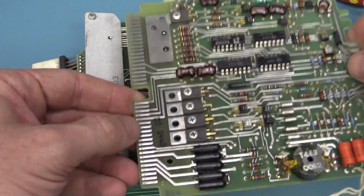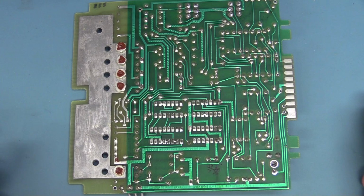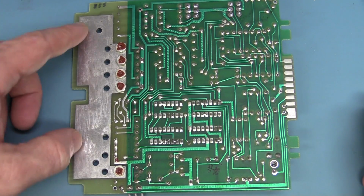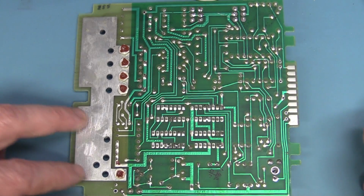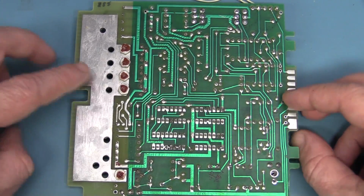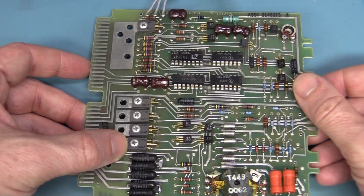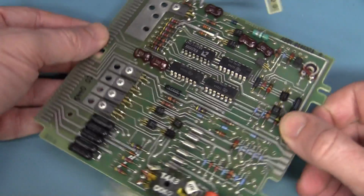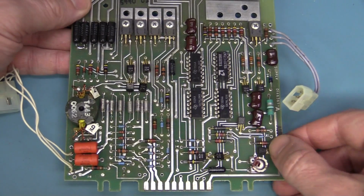They've got some logic on there, but apart from that, the bottom side here, woohoo! And if you're wondering why they've shorted out all these contacts here, because this slides into the, and there'd be pins on the bottom shorting out, well, this is just one big heatsink. You can see the screws there. They've got some Loctite on those, and they're just these little power transistors there, and they're just heatsinking those. So this is the power supply board, and not a huge amount going on here.